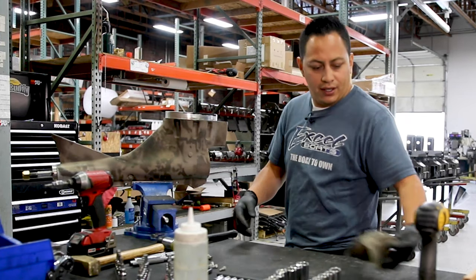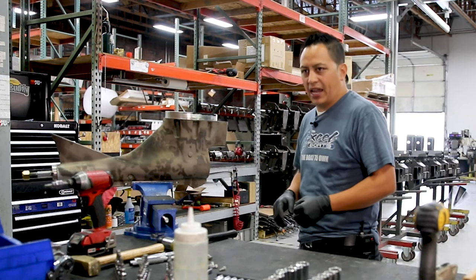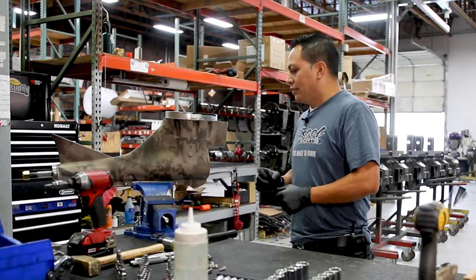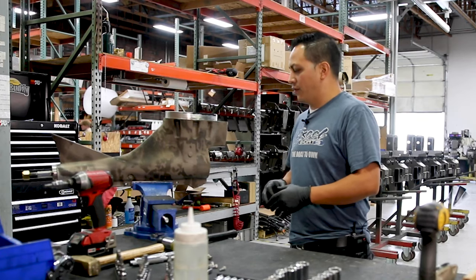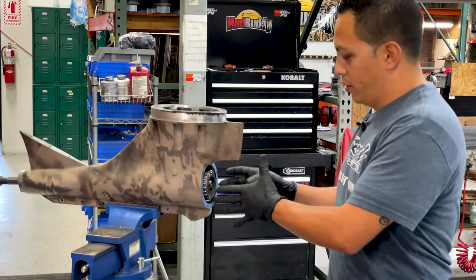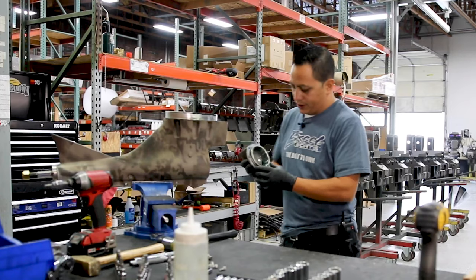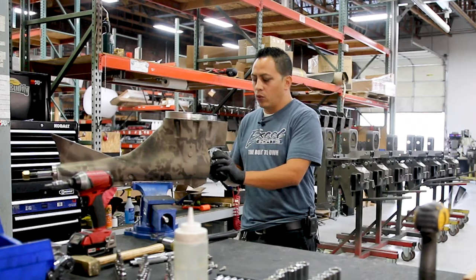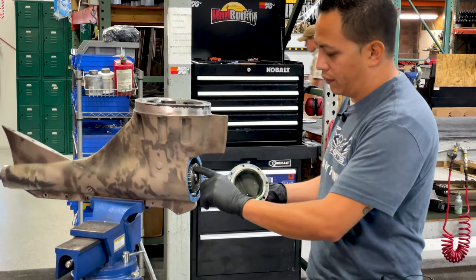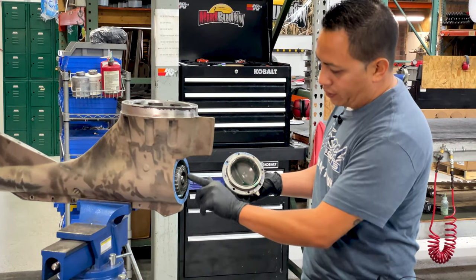I left this thing upside down draining for about a day just to ensure that I didn't make a mess while shooting the video. Once you remove the cap from the front of the drive, you have access to the tapered roller bearing. You want to check that there is no weird or excessive scratching on the bearing race or on any part of the roller bearing. Everything looks good.